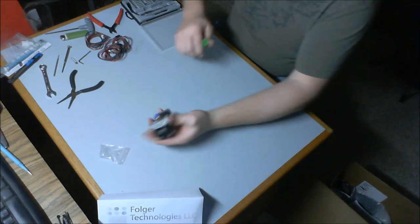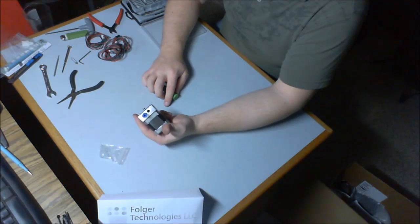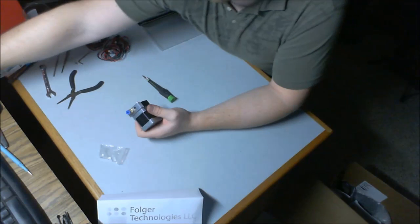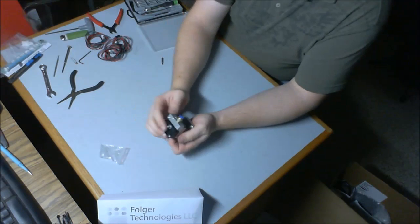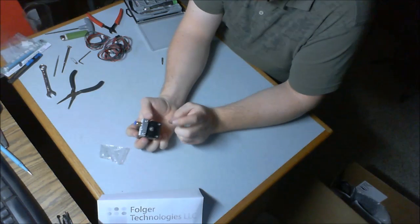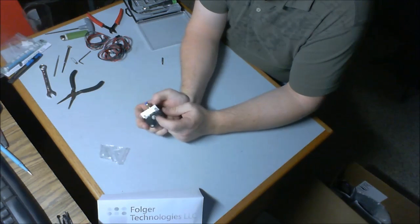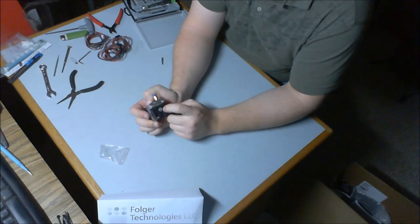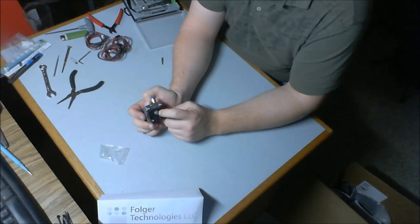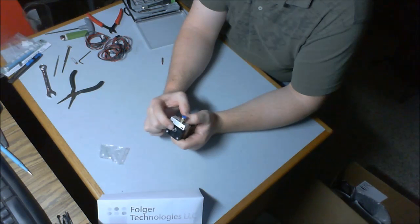And we have just created our extruder. Quite simple. And well, there you go. I did want to add, when making the extruder, you want the little grub screw that sets the toothed drive gear. You want the grub screw out towards the end of the shaft.